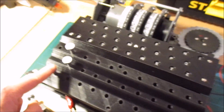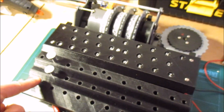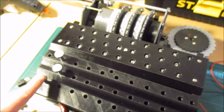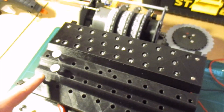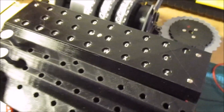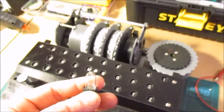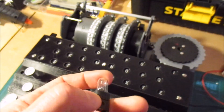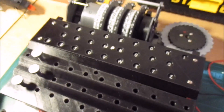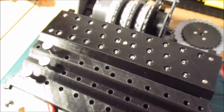Of course, at the moment it's all just hardwired, so the same letter lights up every time. But what this shows you is you can see the rotor actually moves — as you press the key down, the rotor moves and then the light comes on. There's just a slight delay there. Because I'm using incandescent bulbs rather than LEDs, you get that nice fade in fade out effect. I prefer that for this sort of machine rather than an LED, which just comes hard on and then turns off very quickly.